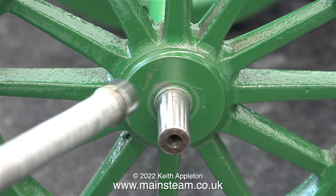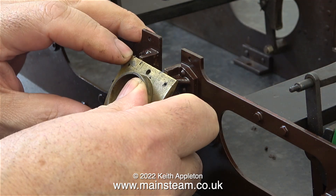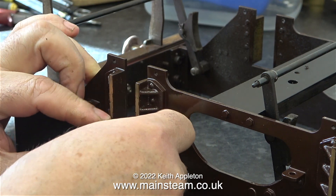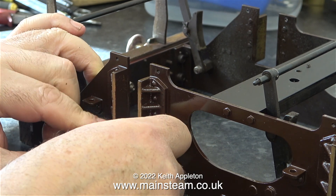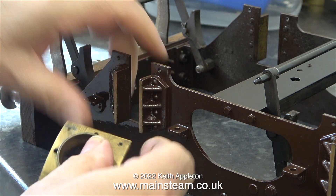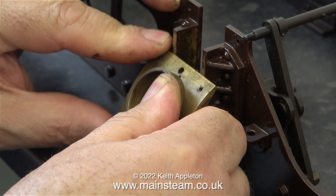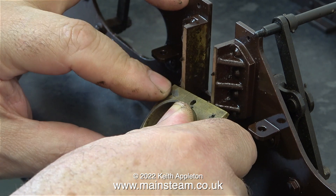As always I assemble the parts with a generous application of lubricating oil. Before fitting the axle boxes in place I'm removing the paint from the edges. I'm using a piece of brass for this that once held the chimney inside the smoke box — I didn't refit this part inside the smoke box because it doesn't actually do anything other than fall off the bolts after a while, but it's good for scraping the paint off the edges of the horn blocks. Rather than do this one axle at a time I cleaned off the rest of the paint from the other horn blocks.